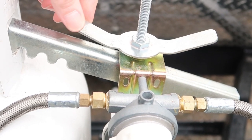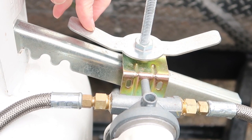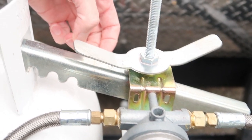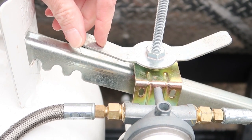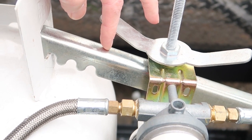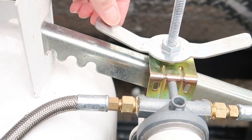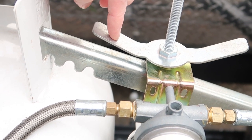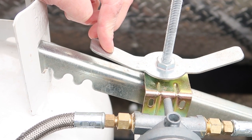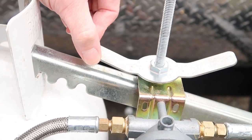What we're going to do is take this nut off, bend one of these arms for the nut straight so it's flat, so it'll sit flush against this bar. Then we're going to drill a hole through here and have that hole line up to a hole that we'll also drill here. That'll give us the ability to insert a padlock through here. Using a standard padlock will be a much more affordable option to lock in your propane tanks instead of using one of the commercially available products on the market.